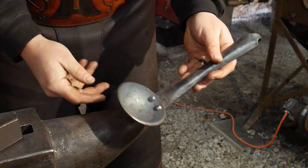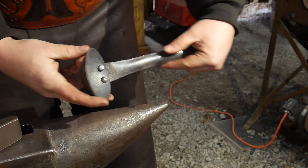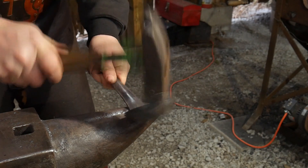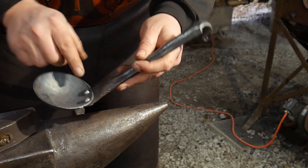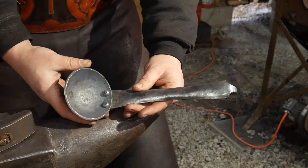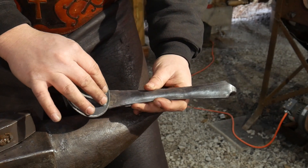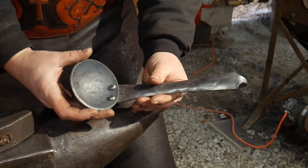One nice hook tail ladle, just as simple as that. Now if you don't like the angle — say it's too steep and you want it shallower — you can always adjust that by heating it up again while it's riveted and bending slowly. Just aim your heat in that area and bend it out to the pitch you're after. With riveted joints, you may have to snug the rivets up again after any last-minute adjustments.